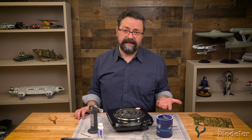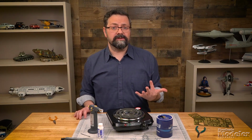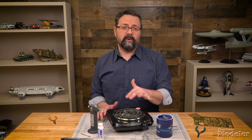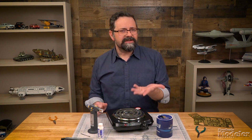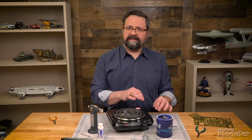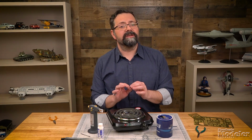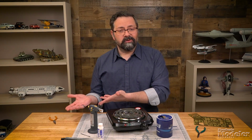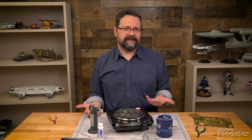Now, for the examples in this video, we used brass. There are manufacturers who use stainless steel for their photo-etched metal parts, and that's fine. You can anneal it the same way. However, you're just going to have to adjust for temperature, right? So when you're doing it, just make sure you're keeping an eye on it, and once you start seeing that it's starting to turn red, then set it aside. Remember, you can re-anneal if it's still not as bendable or as shapeable as what you want it to be. Just go back, anneal it again, and let it cool, and then test it. And once you've done it a couple of times, it'll start to become second nature to you.